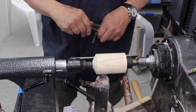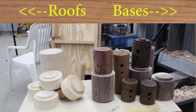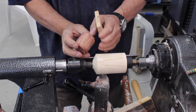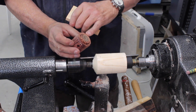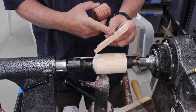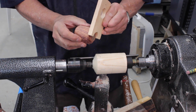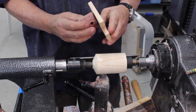I'm going to show you the components of my birdhouse. I'm going to make them a little bit simple - I'm not going to put a finial on the bottom. This is what I'm aiming for right here - this is the base. That's some Mexican kingwood, which will be really pretty. This tenon right here I've sized to an inch and a quarter. I have an inch-and-a-quarter jig with a hole drilled through it so I can check that dimension on the lathe.